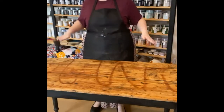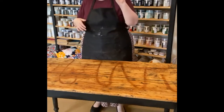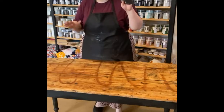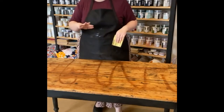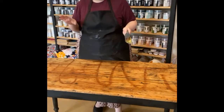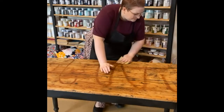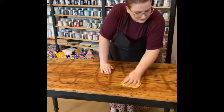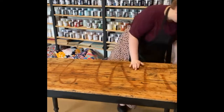But if you don't want that yellowness of the pine, go in with some Purico Stainer Glaze in the color Whisper — that's just going to neutralize that orange. So now we've got our oil on. Before we buff it, we're going to go in with some sandpaper. I have got a 600 grit — you want anything 600 plus, preferably in the thousands. All you're going to do is sand in the direction of the grain. This is going to help press that oil into your timber. It's also going to knock down any of those fibers. When timber gets wet those fibers naturally stand up — that's when your timber can feel a bit furry, a bit fuzzy. This is going to knock those fibers back down and give you a baby-bottom smooth finish. Every timber is different as well.